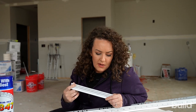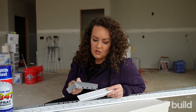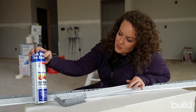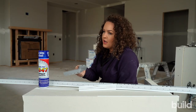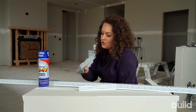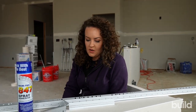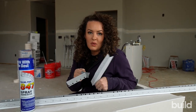Vinyl gets dogged a little bit sometimes. I'm not sure why — I think it's because people just haven't had the chance to work with it and go with the traditional product. But let's go ahead and do that smash test. We did the vinyl sprayed with the 847 and staples. The metal one you can install with screws, nails, or inch-and-a-quarter, eighth-of-an-inch galvanized staples out of a staple gun. The vinyl is a lot easier to install — just glue and staple. Which one do you think is going to do better?